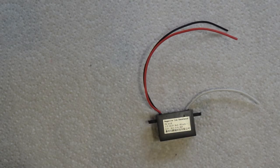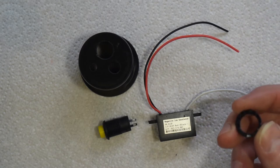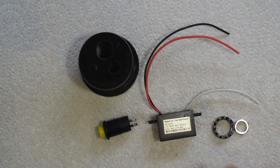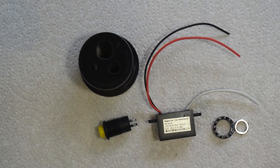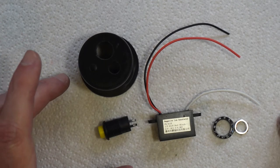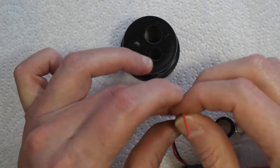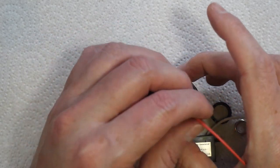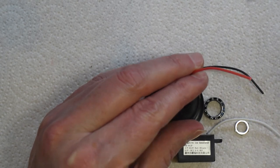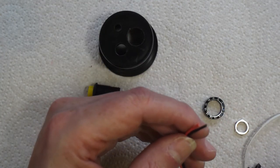Now it's time to start with the wiring. You have to think a little bit because it's very easy to get it wrong. The main thing to remember is to put the nuts for the various switches over the wires before you connect the wires to the switches, otherwise you won't be able to connect them afterwards. The live from the ion generator needs to go to the switch, and we also need to sort out the live from the LED — I'll cut these wires to the same length.